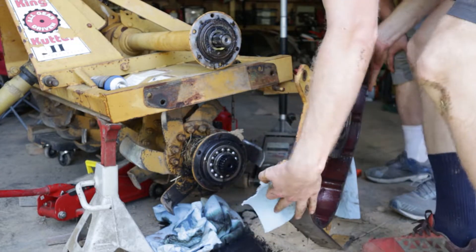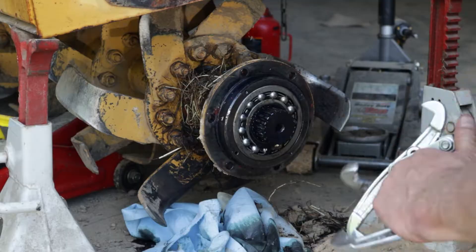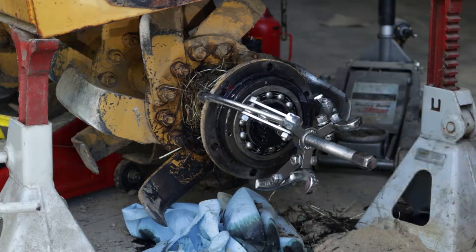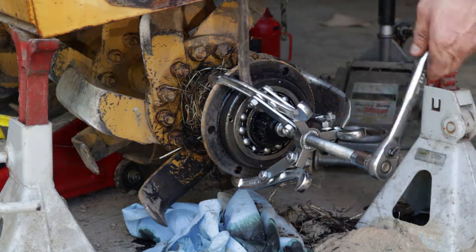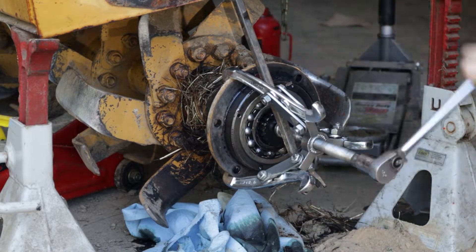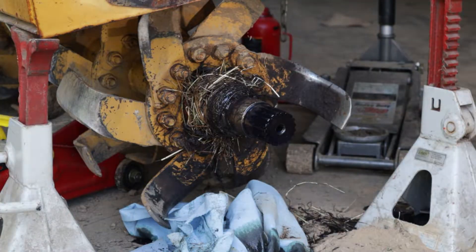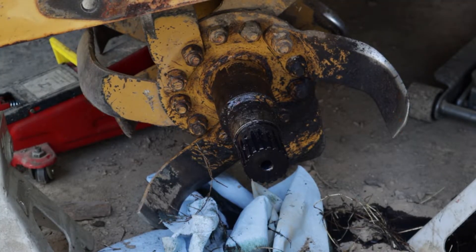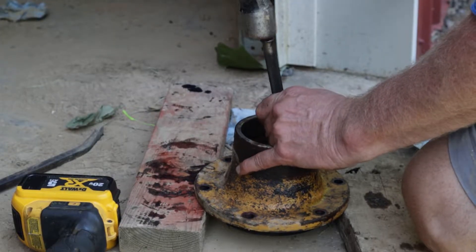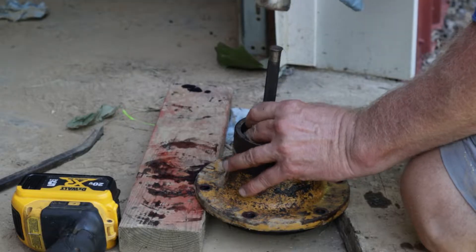This is a great time to clean that housing up real well and wipe off the gears, inspecting everything for damage. Continuing on with the rebuild, the next step is to remove the hub. Fortunately we have a hub puller in the vast array of tools my father has laying around, so this was an easy step. I've read online about people using a mallet and wood to get these removed, but I've never tried it so I don't know how well it works. Once you have the hub off, clean up the work area and it's time to pull out the bearing and seals.